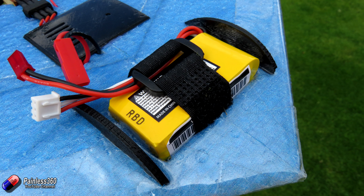The 4mm plug also helped because I lost a little bit of mass from the aluminium spinner at the back of the craft, which helped with centre of gravity too. The 2S setup gives me plenty of power - it'll still do acrobatics and zooming around, go very floaty, and also have a nice turn of speed and go vertical. On that battery, if I'm pootling around I can get anything up to nearly 13-14 minutes. If I'm flying more throttle full out all the time, then I'm down at 9 or 10 minutes. To get that from such a little battery is pretty impressive and shows you how light this thing actually is.